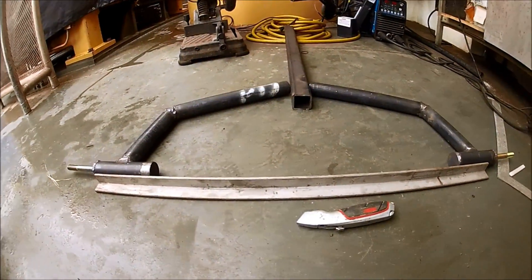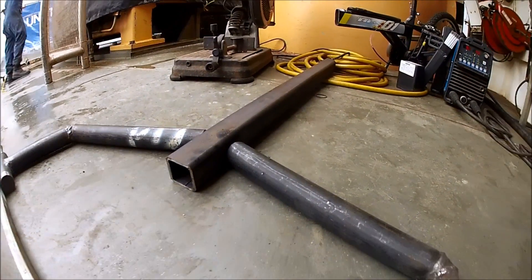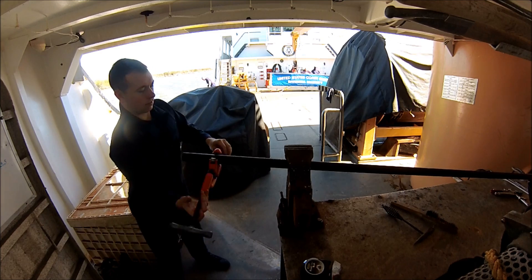This tutorial is going to show you how to make a rear axle of a drift trike. First we're going to start with the back pegs. We're going to use inch and a quarter round tube and two grade 8 bolts.